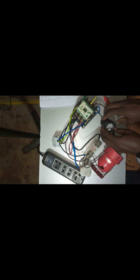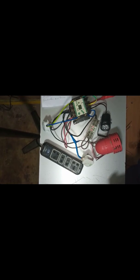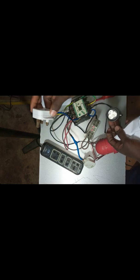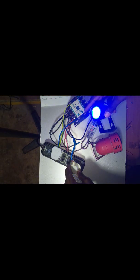If this one lights, the light will shine — so you know your house is now being supplied. As we are testing now, this is my load. This is my generator part. So immediately, maybe you are using your generator, there must be power. I will go ahead on the generator. So you are not using your generator and your generator is giving you light. And let's say they bring light — once they bring light, this alarm must sound. And this timer must control the alarm. And your contactor will energize and switch to NEPA.